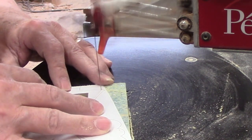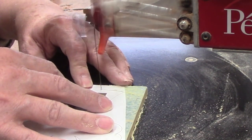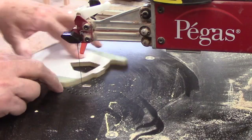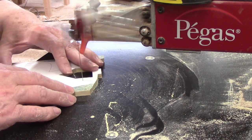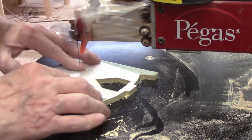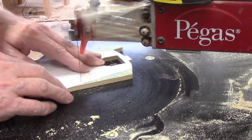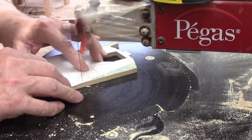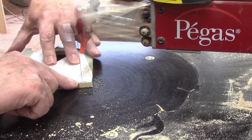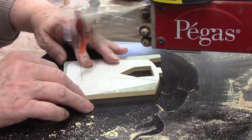I could make these corners by cutting from the outside and swiveling the workpiece at the intersection, but sometimes the corner made that way is slightly rounded rather than sharp — this results in a sloppy fit between the tab and slot. The outside cut on the angel is routine and uneventful. The first part that requires much concentration is the angel's wing, because cutting those semi-circles involves rapid changes of direction. I followed the line to the first scallop, then briefly hesitated at the intersection where the direction changed, backed off pressure on the blade slightly, swiveled the workpiece to the new cutting direction, and started cutting again. These shapes are close together, so it's only a matter of seconds before I come to the next intersection and have to perform the same maneuver again.